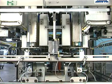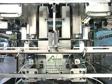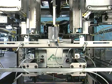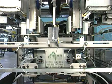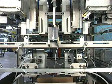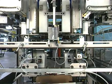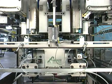Serrated pawls at each corner of the mandrel engage the end panels and drive them down for mating with a glued body wrap. The mandrel, whose working surfaces are constructed of two-inch by six-inch UHMW polyethylene, drives the three pieces into the die cavity. Powered fold shoes lever the sides of the body wrap to a vertical position and compress the internal flange glue line. Large hard black anodized die plates impact on internal flanges, completing glue compression on the box.